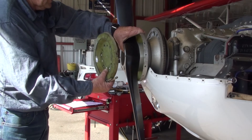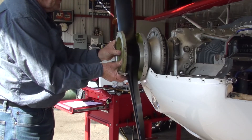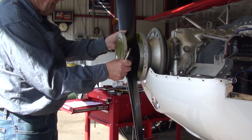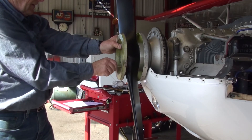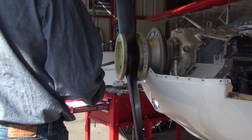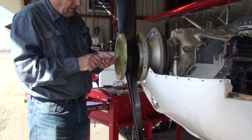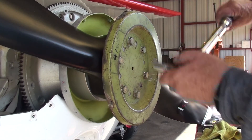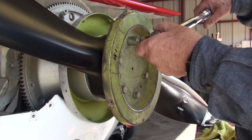Don't forget your forward bulkhead — point it in the right direction. The bolts go in dry; you do a dry torque unless otherwise specified. When you're using a torque wrench, use a criss-cross pattern and bring it up slowly, a little bit at a time. I've seen a lot of guys just yank it.